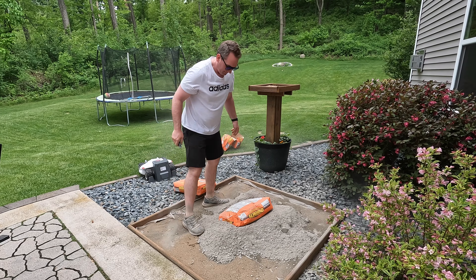I took a ninth bag and dug out some more of the cement from the bottom and kind of top-dressed with it to try to cover some areas that were low or where a lot of aggregate was showing. After the top dressing I re-screeded using my tamp-screed method. After filling and screeding the entire form, I moved on to the edge tool. This was a little bit easier to work with than the screed board for making sure that aggregate was pushed down into the mixture — kind of fun, like making a sandcastle without too much water.